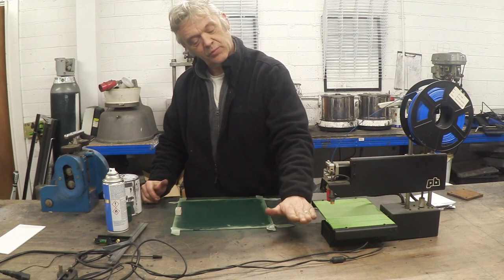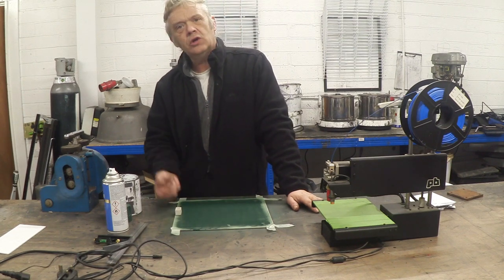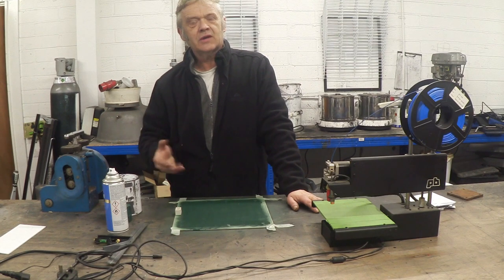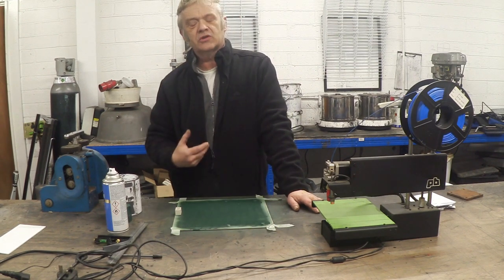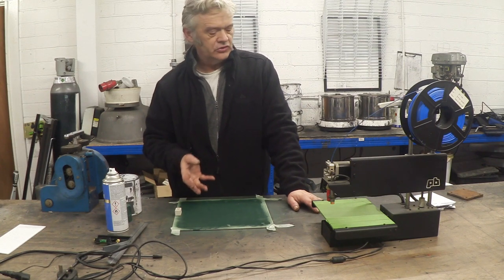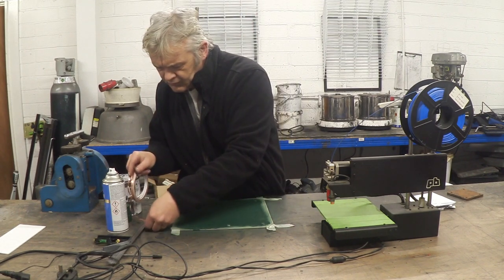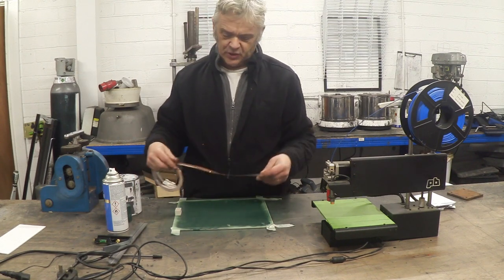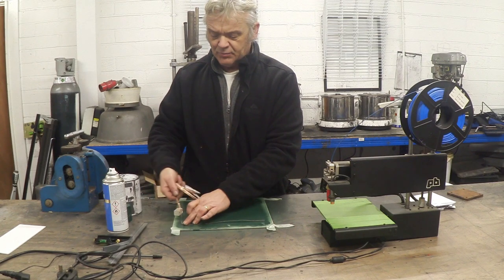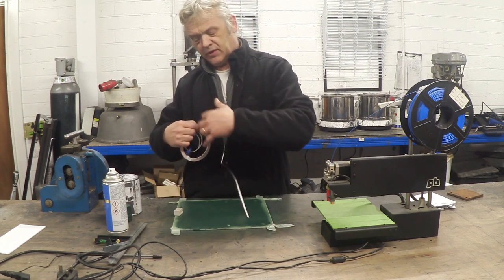The ceramic block will sit about there. When fitted to the 3D printer, it'll be facing down with the connector overhang underneath the plate. A small overhang with a downward projection doesn't get in the way of the mechanism — you just need to place it where it won't interfere with the forward-backward or side-to-side movement. To make the connections I have five-millimeter copper tape, which I'm going to attach and bring to that contact point with a little fold, then another fold and into the block. The glue side I'll fold over copper-against-copper.